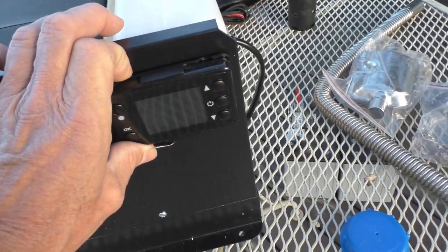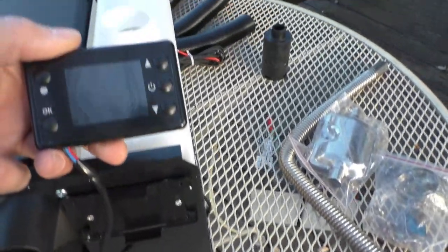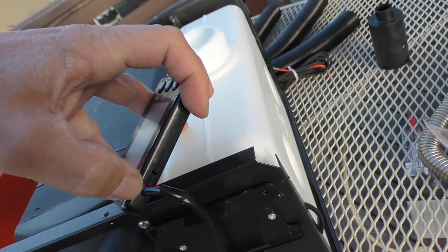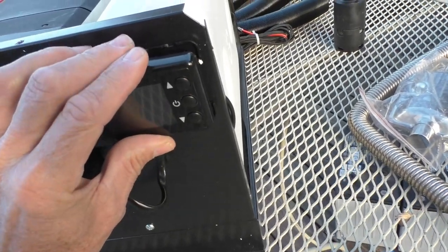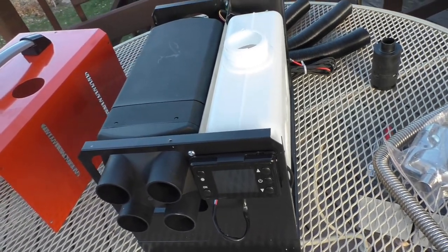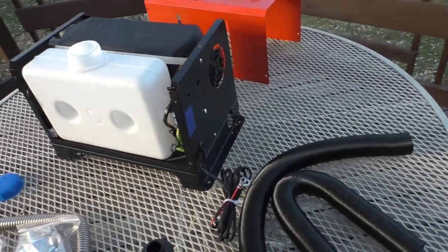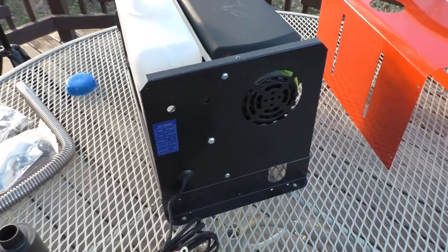It has this control panel which is basically removable, so I can take it and place it elsewhere. This hole at the bottom here is a thermistor port, so it's supposed to read temperature like a thermostat in the house would — we'll find out how that works. I'll be extending this cable so that I can actually reach it inside the building. I've decided to leave this unit probably outside, which may be an experience since it uses diesel fuel. Being in the box it'll probably stay a little bit warm in there anyway.